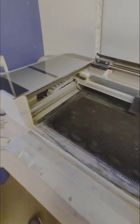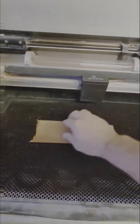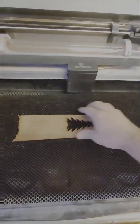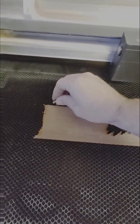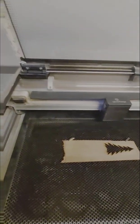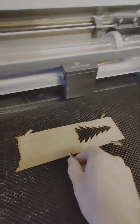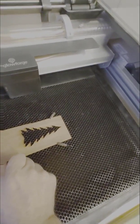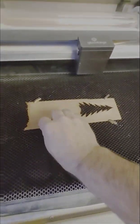Another possibility is that your wood might be warped. Some wood is really curved, and if you lay it down it's not going to be flat no matter what you do. To fix that, you get honeycomb pins — available from the Glowforge website or the forums — and use them to pin your wood down. Some people make them out of acrylic because when made from draft board they fall apart pretty quickly. Some pins seem to go in straight, others go in better at an angle — these are going in nicely at an angle, so now this wood is flat.